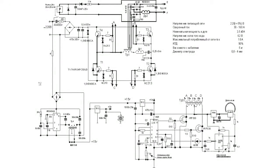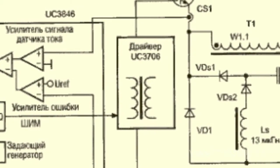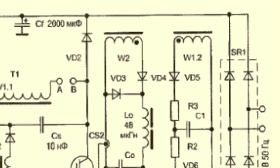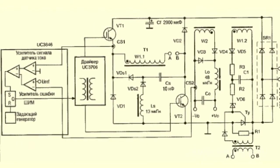In operation, a welding inverter uses high frequency current of tens of kilohertz. The increased frequency of the current flowing through the power transformer helps minimize the dimensions and mass of the devices. The value describing the ratio of the welding current to the mass is now close to 4–5 amperes per kilo. Inverters can be used even when power surges occur in industrial electric generators, as well as when using long cables.